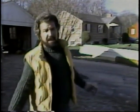Now, one of the things I wanted to discuss first of all today has to do with the concrete breaking up that I wanted to do. Remember, I was talking about these front steps on the house. Like all the other houses around here, we have a big set of front steps and a front door and a front walk that nobody ever uses. So earlier this week, I got started with an electric jackhammer that I rented, and I broke up most of my front walk. We figured we didn't need a front walk that leads to a street with no sidewalk or anything, so the electric jackhammer broke up this 4-inch slab for me without hardly any problems at all.